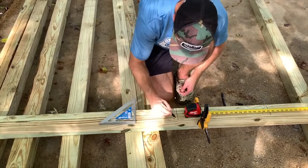Now, while we wait for the epoxy primer to dry, we're gonna go ahead and mix up our metallic epoxy pigments and allow them to saturate in the epoxy overnight. Okay, so to install this, we have a 3-gallon kit right here, and then we have a 1-gallon kit right here. The general rule of thumb is 4 ounces of pigment per gallon of part A. So we're gonna take 4 ounces and 8 ounces of this, for 12 ounces to go into our part A here. This is gonna give us kind of a white base coat. And then we're gonna put about 4 ounces of this dolphin in the smaller 1-gallon can. So we'll mix all that up and we'll go from there. You can either mix with your mixer right here, or we're just gonna mix this up with these sticks. Let's get into it.